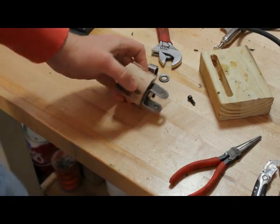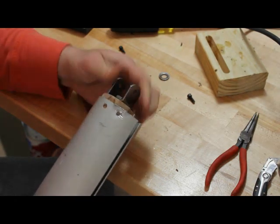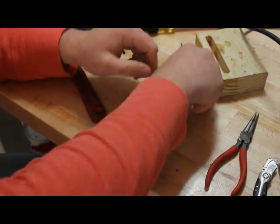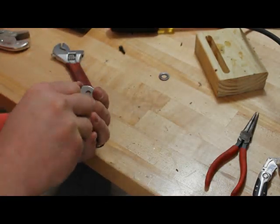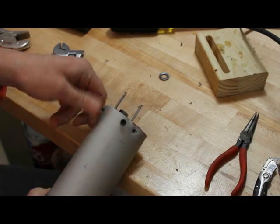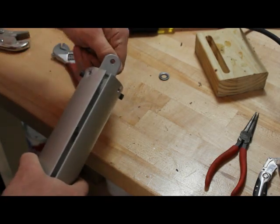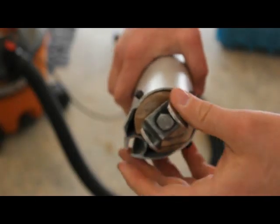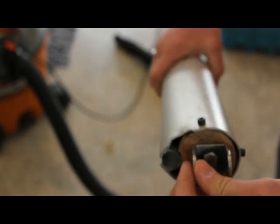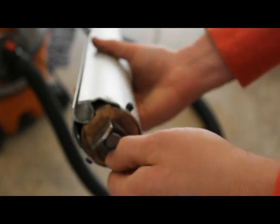Pretty solid. Let's see if this thing is going to fit in here. Screws seem to line up somewhat, so we'll screw it in and see if it'll work. There you go — there's my custom end cap for my boom, for my Prindle 16, like a Hobie Cat 16. Here's another view of everything: there's the wood cap, the clevis, and these 10-24 screws are holding everything together. If you make one yourself, be sure to let me know in the comments — I'd love to hear about it.